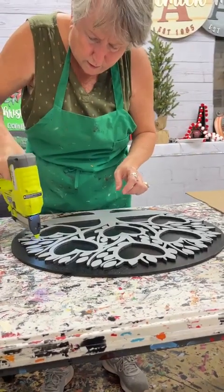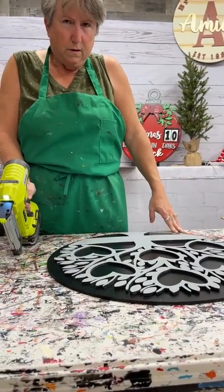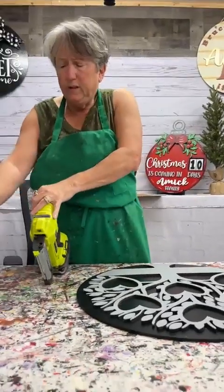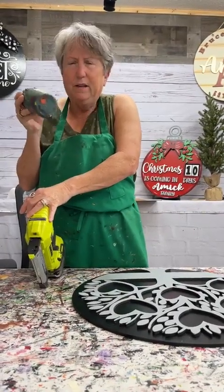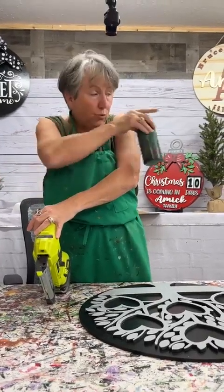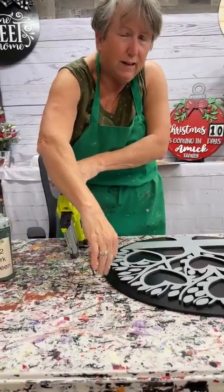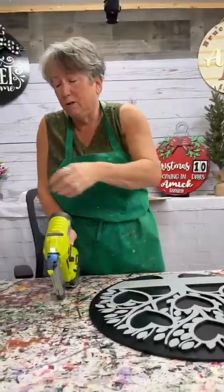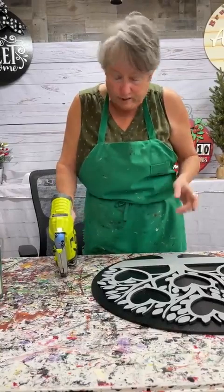Kim said, but if I mix my own with no stain, would I still be able to use it? You mean with paint only and still get that effect? If you wanted to just do paint only, what I would do is use this. If you want that more olive, you're probably going to have to put a little bit of black in here, because this has a little bit of blue in it. The other thing you could try, if you don't want to buy the stain, is water the paint down a lot. Now, this is if you're using wood. That's wood, this is MDF. If you're using MDF, I wouldn't put a lot of water on it. I'd just go paint, like on this MDF, I just did paint. And like Ashley said, do a test piece. But I'll be honest with you, if I don't have stain, half the time I water the heck out of the paint and use it as stain, and most people will never know the difference. That's what I do.